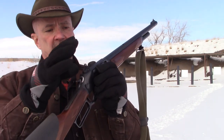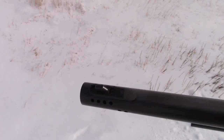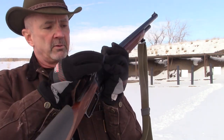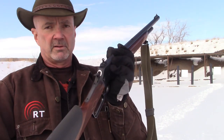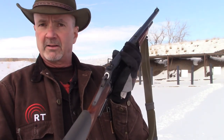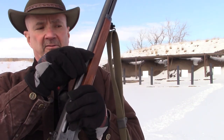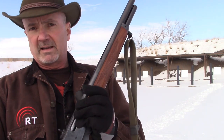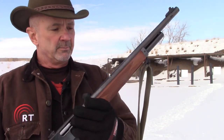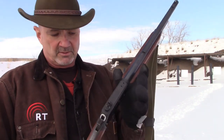One other thing, with a reduced height of the front sight and reduced height of the rear sight, I could probably on my rifle eliminate this neoprene cheek riser. I think though, with having to push my rear Ghost Ring sight up so high, it actually works out for me that this neoprene cheek riser puts it in about the right place, so that works out all right. I do know that I think they make a filler for this dovetail cut in the barrel there, which would make it look a little bit better. It looks a little sketchy, just that raw dovetail there. It doesn't hurt anything, but it'd be nice to have that smoothed out a bit. But I'm not real big on looks. To me, it's just functionality.